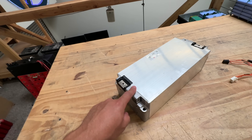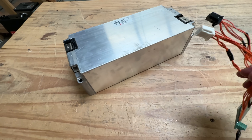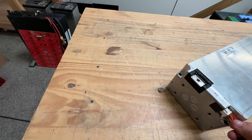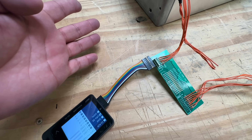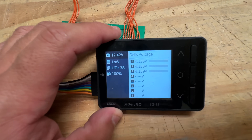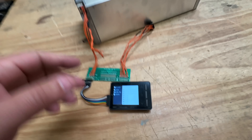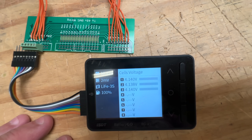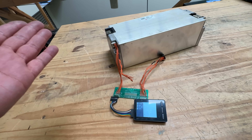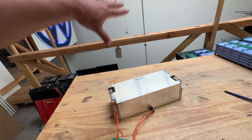I charged it all the way and now we're going to discharge it. I've also figured out the pin-out — there are two kinds of modules: one with a white connector and one with a black connector, and the white connector is the one that works. There should only be about four cables that are actually usable; the others are probably temperature sensors. Right now the cells are sitting at 4.1 volts. I've had it for about a week — charged it and let it sit, which is always a good practice. If a battery is faulty it'll lose voltage; if it's good it'll stay right where it is.